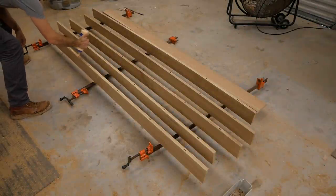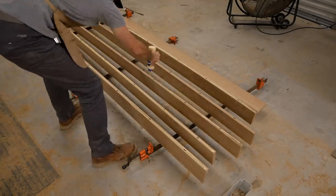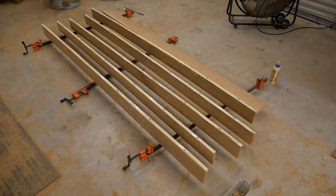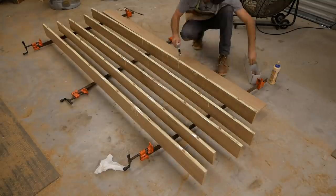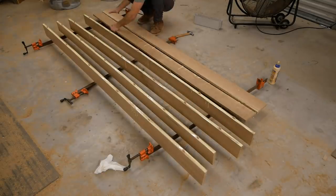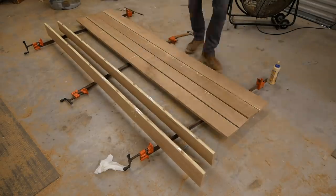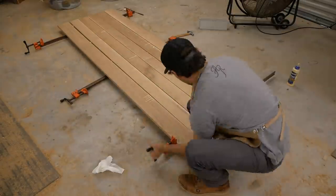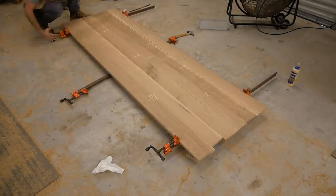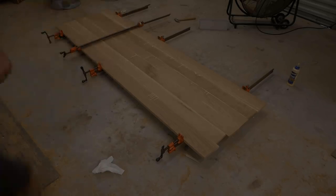Another thing I love about that machine is if you process the wood properly, it leaves really straight edges and I can go straight to a glue-up. I'm using dominoes here — I didn't show that process. They're like biscuits. There's no real strength to these; they just level the joints. So when you put together this many boards, you're not fighting with a hammer to get them leveled out. The dominoes take care of that — everything's flush and smooth. It makes the glue-up a lot easier. I would highly recommend using dominoes when you do glue-ups with multiple boards.